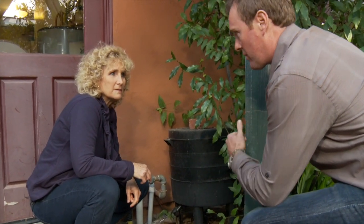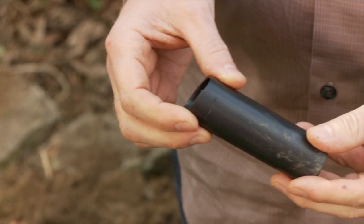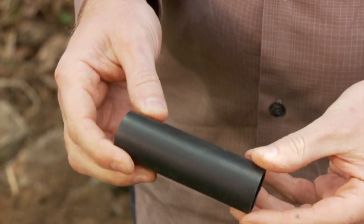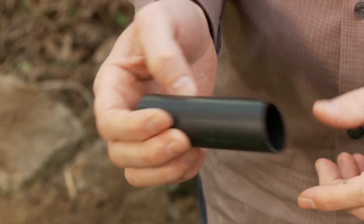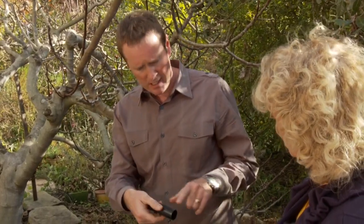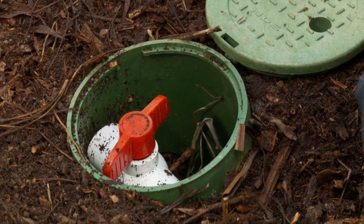This takes the greywater directly to the fruit trees. So once it comes outside to the landscape, we actually transition to a different kind of pipe. We use polyethylene plastic, or PE as it's commonly known. The main reason really is this is a greener product. It's a fully recyclable plastic. It's a lot less toxic. So we keep it 1 inch, which is important because that's consistent with the diameter of a typical washing machine hose. So it doesn't adjust the pressure or cause any complications. Basically, it'll channel the water out, and then we divide it according to the landscape plan.